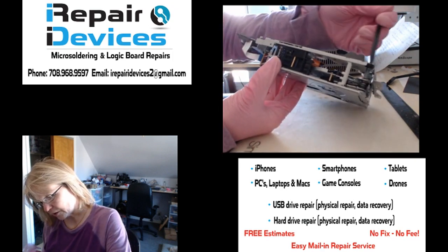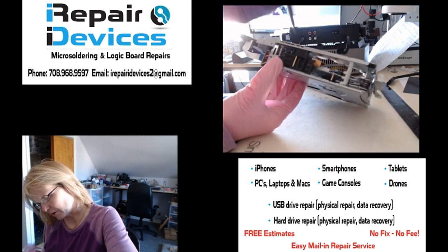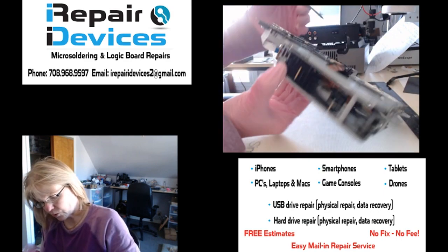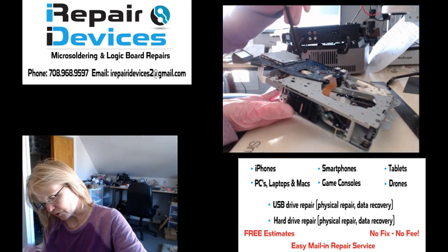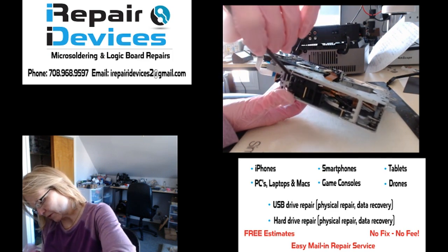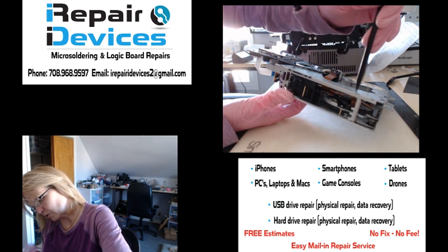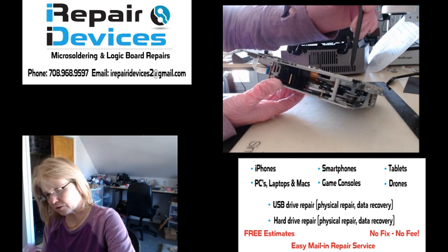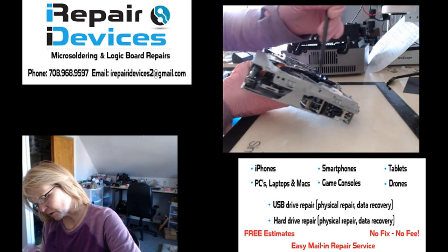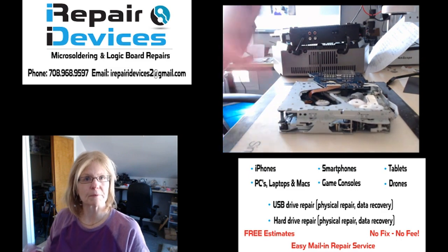It's all linkage gears mounted underneath the top part here. When the clutch is engaged, it transfers power to this gear, to this gear, then it turns this worm gear and continues on. We've got gears up here continuing to transfer power, then turning the next worm gear, continuing power to the next set of gears, then going to the third worm gear. The worm gear is what drives this unit up and down.